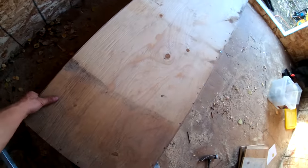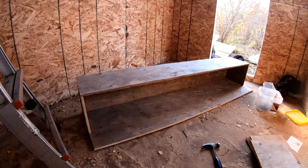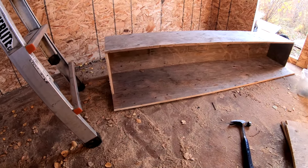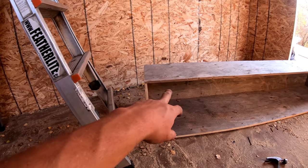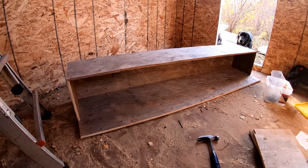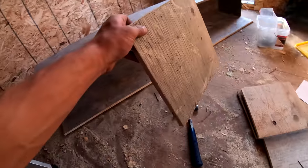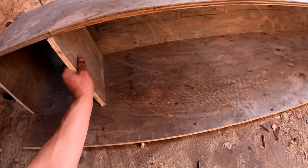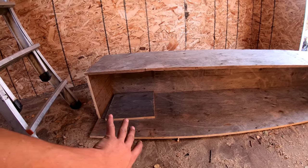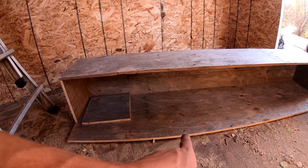I just nailed the bottom of the box in here. I gave myself a little extra room on the front so they can have an easier time jumping up in there. It overlaps 6 inches on the front. The thickness of the side pieces is 12 and 5-eighths, the back one is 12 inches, and the bottom is 18 and 5-eighths. I'm not entirely sure where I'm going to put this yet — I think right in this corner. Now we're going to put in these little dividers every 12 inches, so we'll have to measure that out. This is 76 and 3-eighths inches long, so I can fit six 12-inch openings, accounting for all the 5-eighths pieces in between.